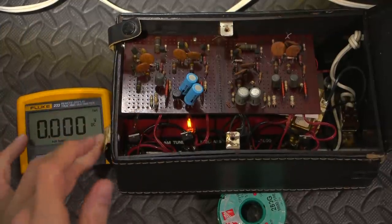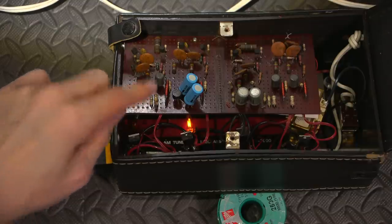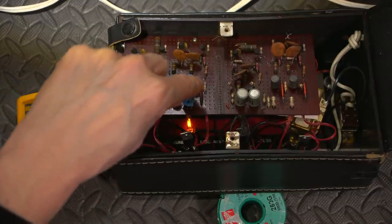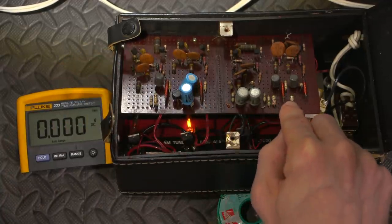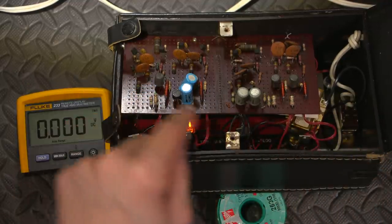What I'm going to do — you can see somebody has already paralleled this one, and it's not doing anything. I believe this one here is most likely going to be for this outlet, and then this one will most likely be for this one, and so on — one for each of these transistors. So somebody's already paralleled this one — maybe because it went open or something like that.